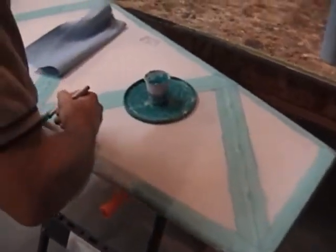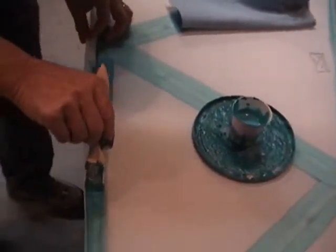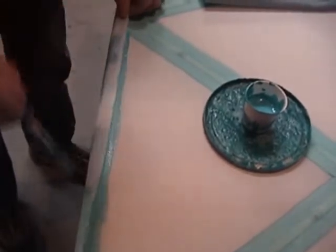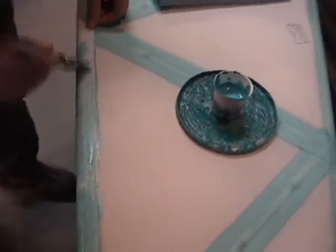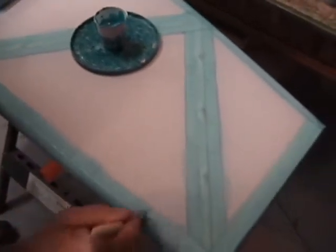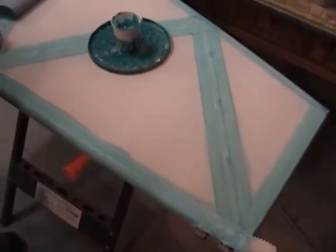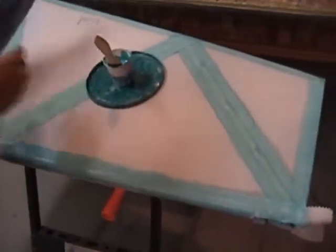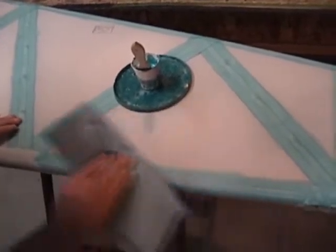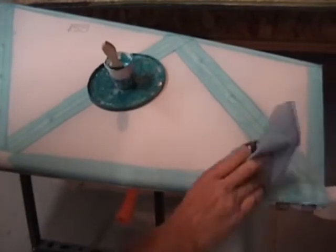The wiping process is a fairly important part of this step. It definitely eliminates any chance of having glue ridges and glue lines show through when you start to put your finish on. You can see that lifted back here — that's not a problem because that glue is still very wet. It lays right back into place. We'll just go ahead and wipe this off, one more little pass brush into there.